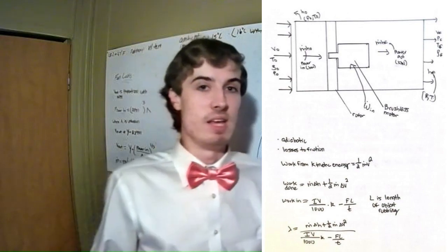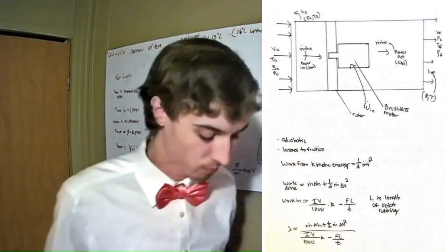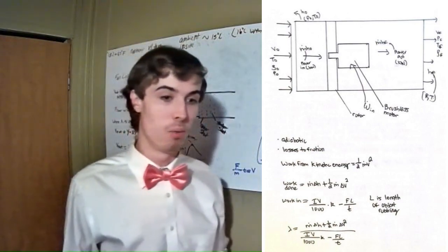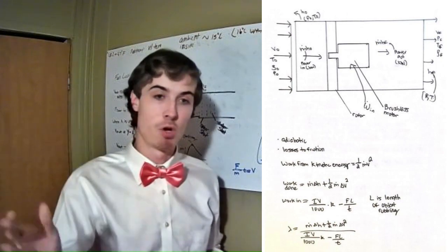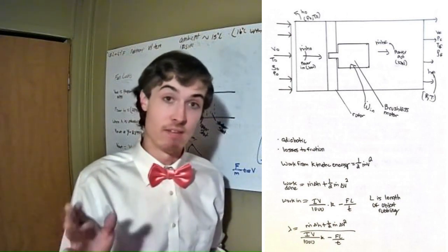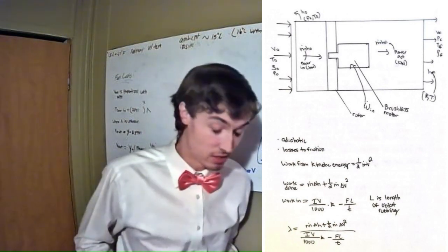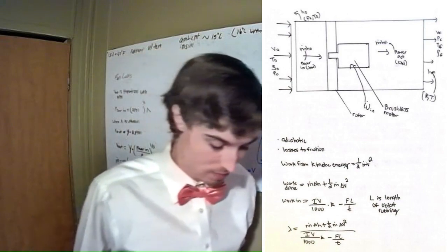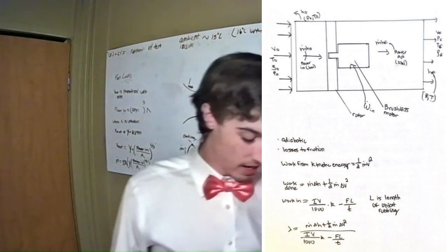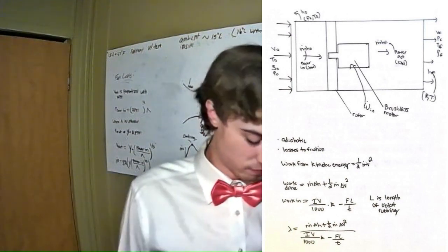And that'll get me the change in total energy across the rotor. So in order to calculate the efficiency, I need to also measure the power going into the brushless motor and then estimate the efficiency of that motor. They're about 90% efficient based on what I read online, the brushless motors. And so my equation, I just put it up here. And I used lambda as the efficiency variable.